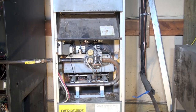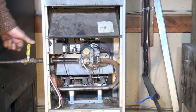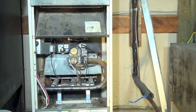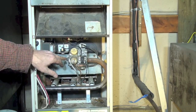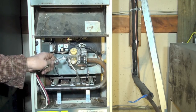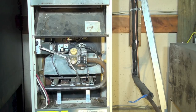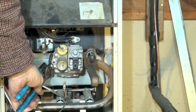This is just an old combination gas valve. The first thing you're going to want to do is come down and shut off the gas, and of course the next thing is to kill the power to the furnace. Then I'm going to pull the gas pipe off, pull the wiring off, pull the pilot tube off, and pull the thermocouple off. When you take the pilot off, use an open-end wrench — you can use a crescent wrench, but it's really easy to round them, so just use a 7/16 open-end wrench.